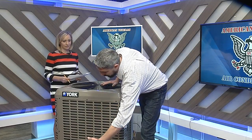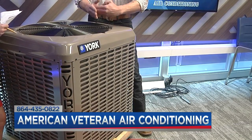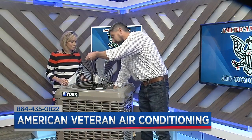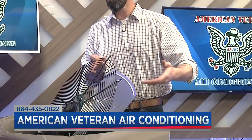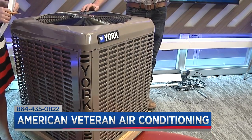The fan on top is pulling air up through the coil. If you just push water back through from the outside, all you're really doing is embedding dirt and debris further into the coil. What should be done is pulling the top fan assembly off, cleaning out any debris from inside the system, and washing it from the inside out to make sure it's fully cleared. If it's really bad, we'll take the grates off as well to remove all those grass clippings. That's the level of maintenance the average homeowner isn't going to do — this is a really sophisticated piece of equipment that needs TLC and professional maintenance, just like taking your car to a mechanic.